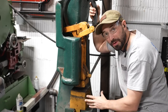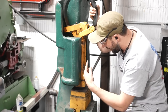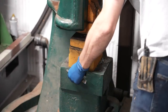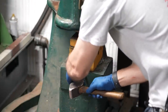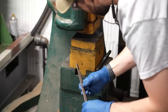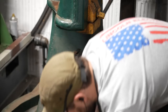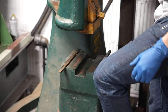The first thing to do is pull the bottom die out, which is in a dovetail with these wedges. We'll pull the bottom die out and see how much movement we can get out of the ram, then figure out what size the die needs to be. Let's see if I can get this die out. Okay, that's pretty heavy. Let's see how much the ram moves without that die in the way.